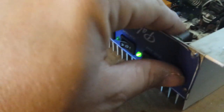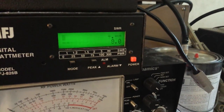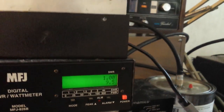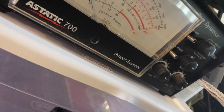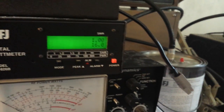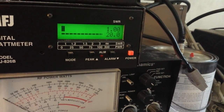The preamp does work as well — just want to throw that in there. Alright, we're going to be putting about 20 watts from the Cobra 29 Bluetooth. Modulation turned up to 100%, still got all the limiters. Got our dead key sitting a little low — let me turn that dead key up just a little bit. There we go, we've got about a 1.1 watt dead key. Alright, 20 watts like usual. We'll go ahead and flip it on — 13.9 volts, we're on the low setting.